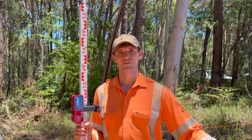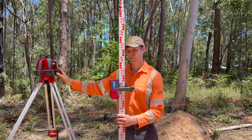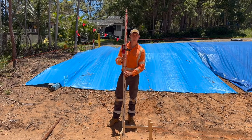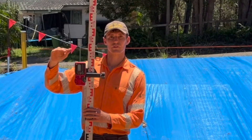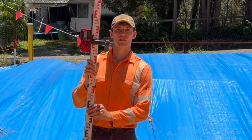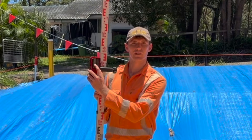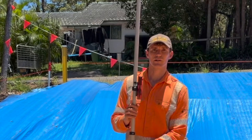When you're doing your batter boards, the best way to level them is with a laser level. You've got the laser here and you've got the staff. Put the staff on top of the first batter board once it's level, then adjust each subsequent board so the staff starts beeping when it hits the right height from the laser. Take it around to each set of batter boards — an arrow will pop up telling you which way to go. It's a much quicker and more accurate method.